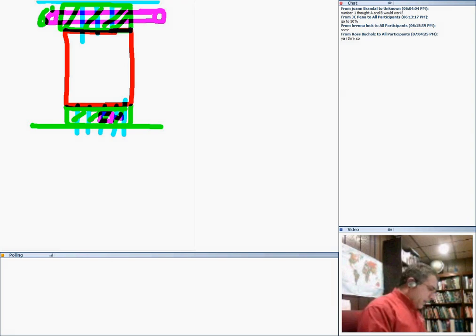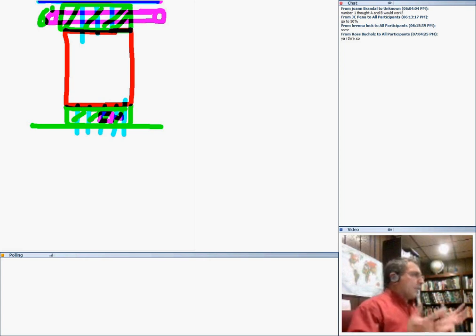Very interesting. Foreign systems: the area above the dedicated space shall be permitted to contain foreign systems, provided protection is installed to avoid damage to the electrical equipment from condensation, leakage, or breaks in such foreign systems. Can I put a suspended ceiling in the dedicated space? No problem. So if my mechanical contractor wants to bring their duct right above the space, guys, no problem, as long as they contain it so it doesn't leak water right above my switchgear here.